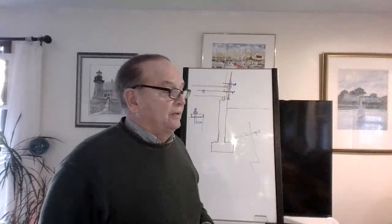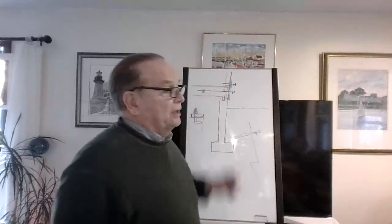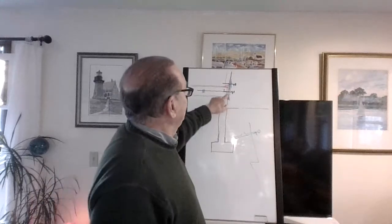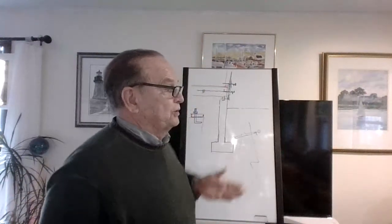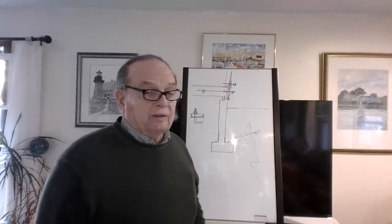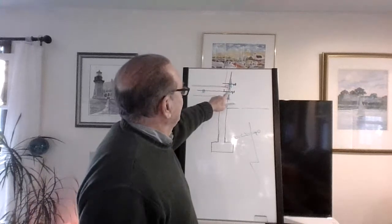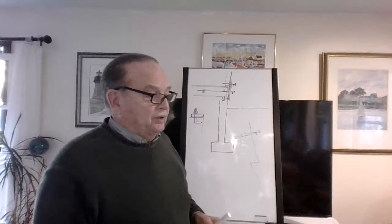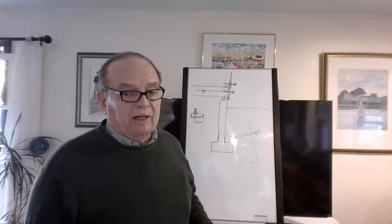Switch it out for a hole saw. By the way, I wouldn't touch a shingle with anything but a hole saw. So you do a feeler bit first, and then you get your hole saw with the 1/4 inch bit in the center, same size as the feeler bit, and just drill in until you get to the joist, that rim joist or whatever you're hitting, or the plywood. Then I would switch off to a twist drill, or what we call a self feed. That's a small one for self feed, so it'd probably be a twist drill for the rest of it. But initially, start out with a hole saw. You start out with any other bit, and what you're going to find is you're going to be splitting and cracking shingles or clapboard, and that doesn't look good. And once you split it, you can't really hide it.